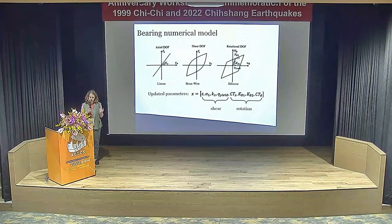So this is very important. When you are doing model updating, you are confined to what you are updating. So it is very important to choose wisely at the outset. And so it's a combination of what you think you can do and what you can update experimentally versus what you think you're going to need to capture in your experiment. So for example, for the steel building, we would have loved to have used and model updated an IMK model, but it was too tricky because of the piecewise linear behavior and the number of parameters. So for the updated version, we used just the Bouc-Wen instead. And so that was that trade-off between what we would have liked to do versus what we thought we could do with our algorithms.